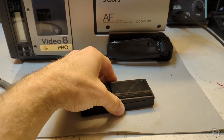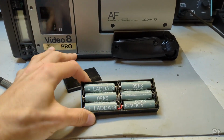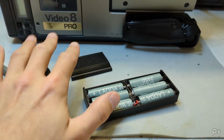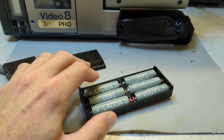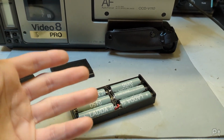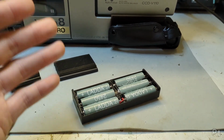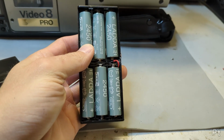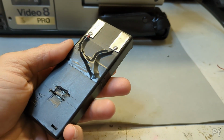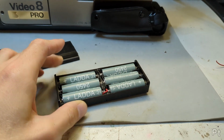Initial thoughts, the battery worked great. I have modified it already simply because 5 batteries wasn't enough. I looked at it, it said 6 volts. I went add up 6 volts, forgetting that, you know, battery rating is fickle. When it says 6 volts, it's expecting like 7. You think about like a 12 volt automotive battery. If it's 12 volts or 11.9, it's getting flat. So adding another one of these gives me 7.2 nominal, and it'll go closer to above 8, which is close to the power supply. So I think that'll work much better.